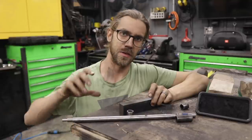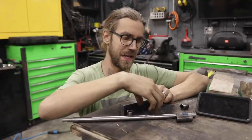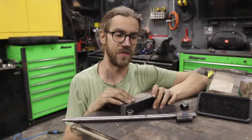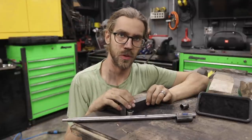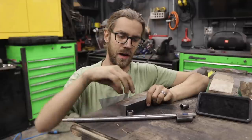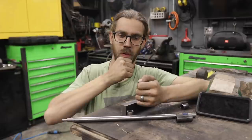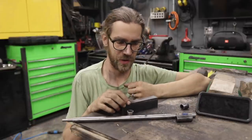Typical designs allow you to adjust the belt tracking on the side, but the problem is if I do a standard side adjustment knob on my belt tracking, it is gonna interfere with the handle that pulls down. So basically I need to be able to adjust the tension and also the tracking in a vertical position. So I can have basically one lever to pull and then an adjustment right next to it. That way they don't interfere.